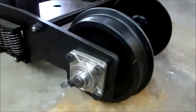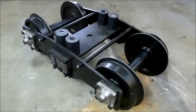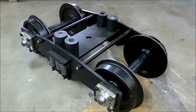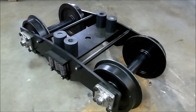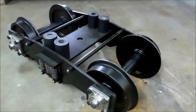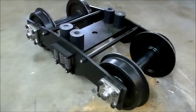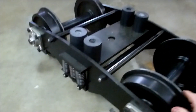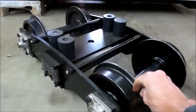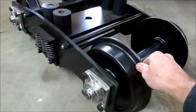Although they're very big and robust and take a lot of weight, if you were to have a derailment on your rolling stock the bogies can get damaged. What tends to happen is you can get a twist between the two angles between the two wheel sets. I've set this bogey up on a flat concrete surface and you can see it's got a very small rock to it.